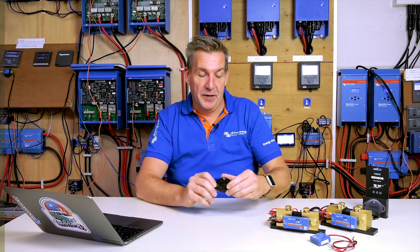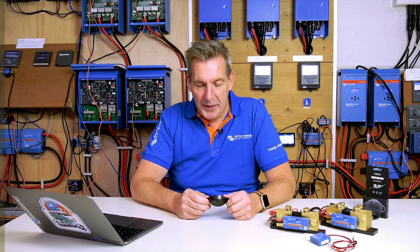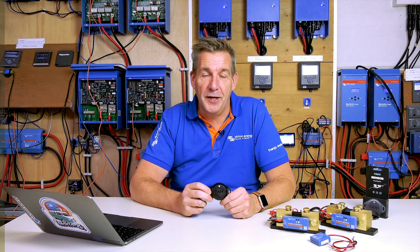That was the last question from this Tech Talk. I also have some new products to share: these sensors. For people already on VRM, it's great to see your system's voltage, amps, and solar yield. Now you can also see humidity, temperature, and air pressure in your system. Just connect this digitally to your GX device via Bluetooth, and you'll see all the information on the VRM website. This works from firmware version 2.8 or higher, so you'll need to update your system.